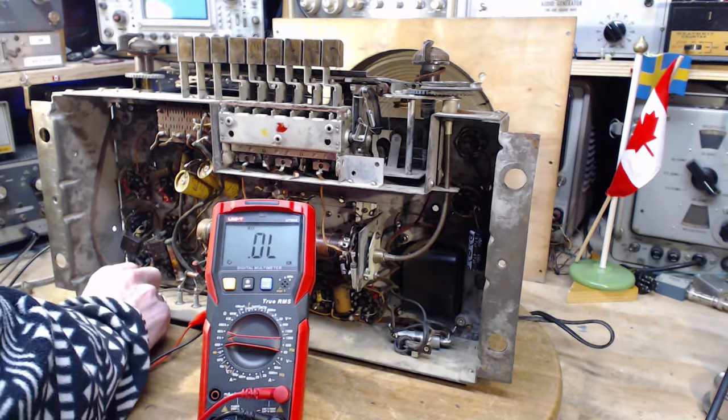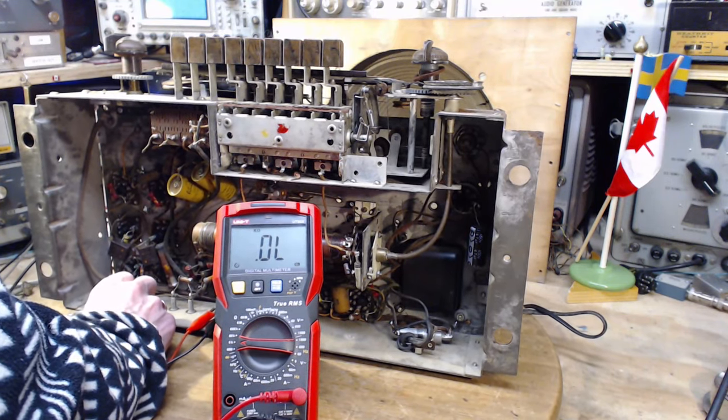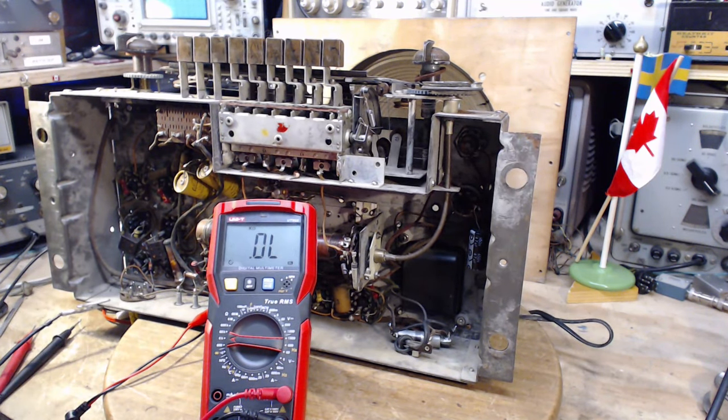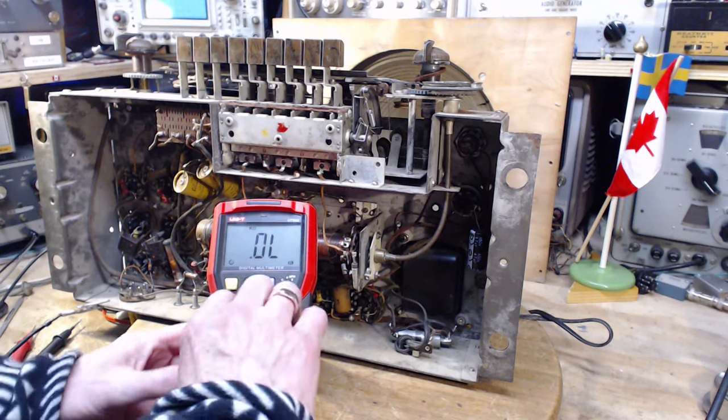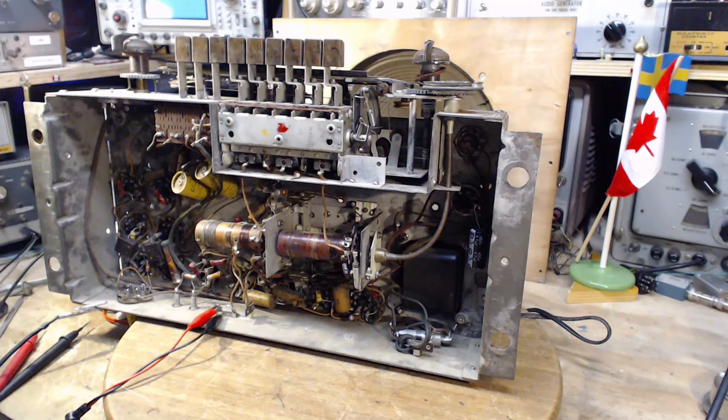And what's my alternative? What kind of resistance would I put in there? It's got to be something with some ability to sustain heat. Sorry about that, thinking about something else while I'm talking. Could it be a wire wound resistor? Most of my high wattage resistors are wire wound. I mean, the field coil is basically a big wire wound resistor. Really, that's what it is.